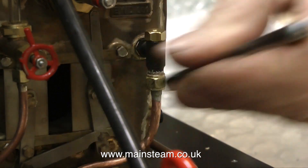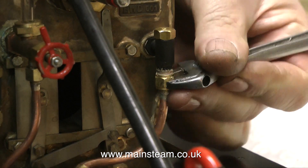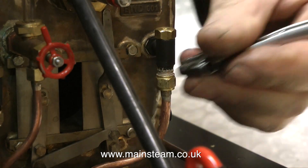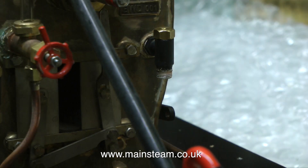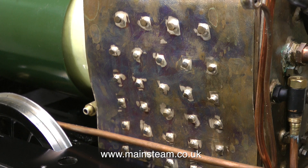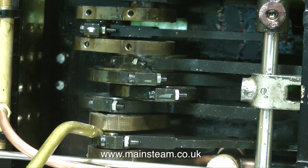What I'm doing at the moment is taking the piping off the engine entirely, starting by removing the union nut which holds the piping that I made to make the injector work. The residue you can see is some Loctite 542 that I used, just to make sure nothing leaked. Because the original plan was to send this complete engine back to China after I fitted the injector, but instead I bought it.